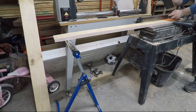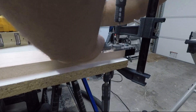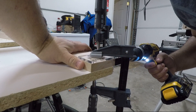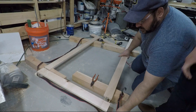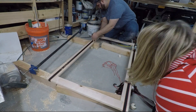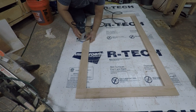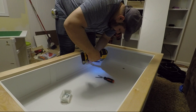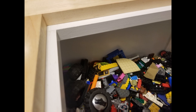The top is going to be built in two parts. The first is a border which consists of four pieces of maple. I mill each board the same as all my other lumber and then attach them to each other using dowels. After a good sanding, I use a palm router to round over the edges. Then I attach the pieces to the table with screws, screwing into the ledge I added on before. It's important to make sure there's enough space all around the board so that the other pieces will insert and rest on them. I've left about a half inch around each side.